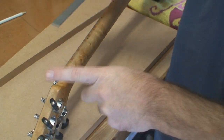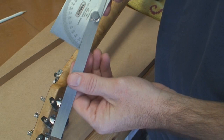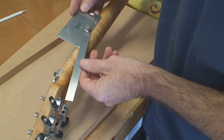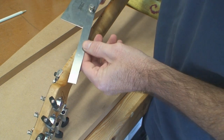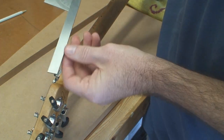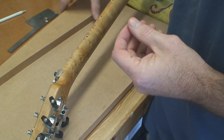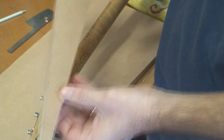What I've already done is measured the angle on this Wolfgang guitar, which is the angle I want on the neck I'm building. Using a little tool, I lined it up just where the fretboard joints and was able to work out that the neck angle is spot on about 10 degrees. I locked this off at 10 degrees and transferred that angle onto a sheet of MDF.